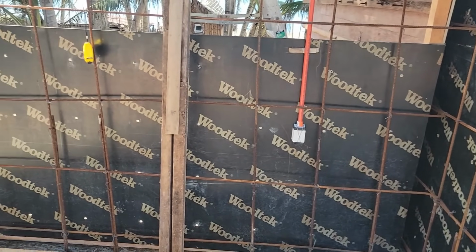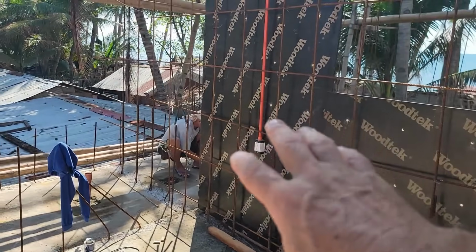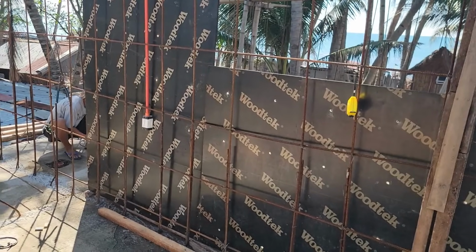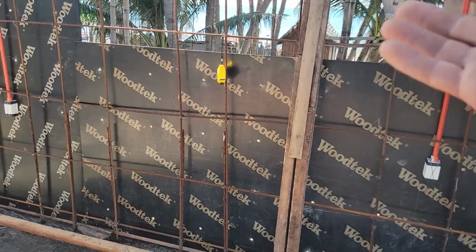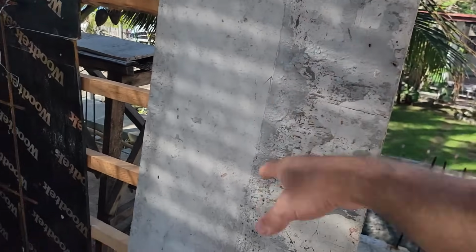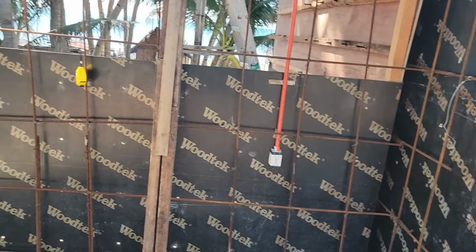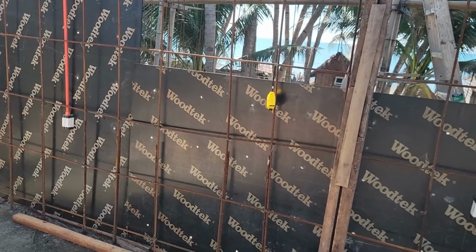So I didn't want like a 13-foot room, because now when you're forming, you get that odd length. So you need to break it up into 4-foot increments. Your sheet lengths are 8 feet by 4 feet, and maybe you might split and have some 2-foot sheets, like the old sheets we have here. These are 2-footers. You need to work in increments like that, but you don't want to end up with 12 foot 3 inches, 13 foot, odd things like that.